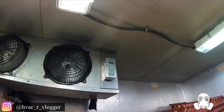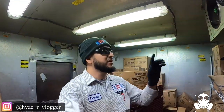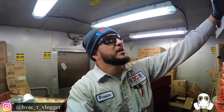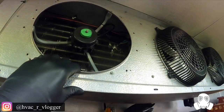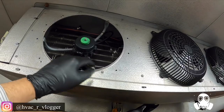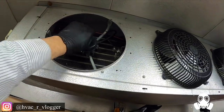Let me go ahead and install that fan and then check the rest. A little background on that fan blade — we didn't fully diagnose it; the manager just took a picture and sent it to our manager. I'm going to install it and take amperage to see how it's running because I don't know if this motor is going to be good. Anytime those fan blades break, a lot of times it starts messing up the motor.